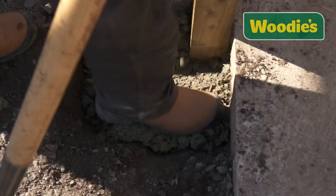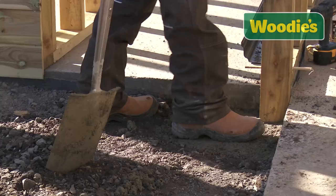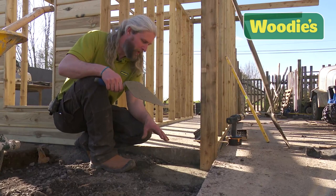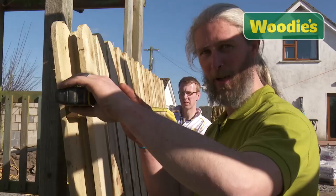When I'm halfway, what I like to do is tap it down with my foot or a stick — you can use whatever you wish. This helps to compact and get rid of the air as you go. The cement's now in the hole and it's all finished. I like to leave it nice and smooth, so I use a trowel and give it a trowel finish.